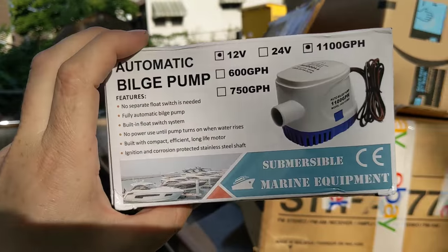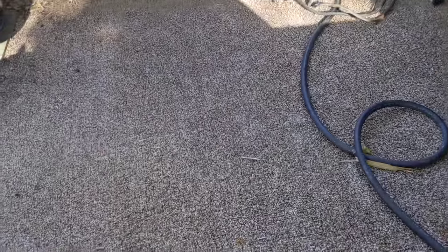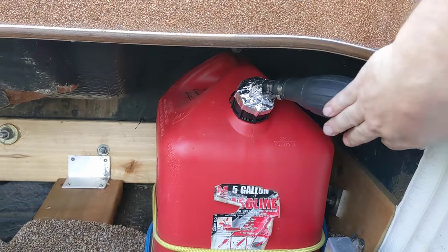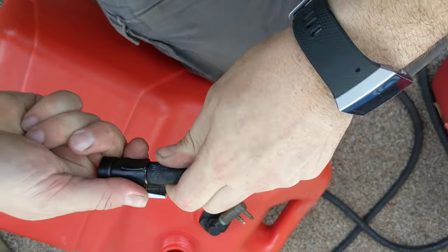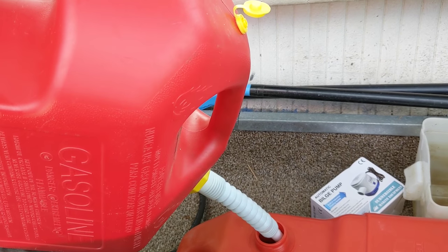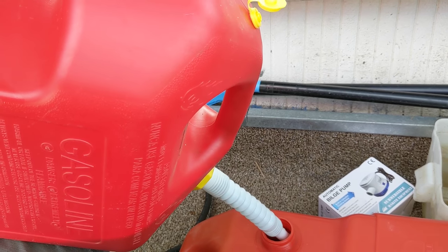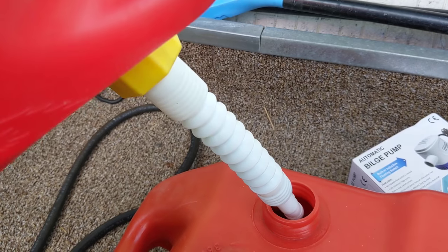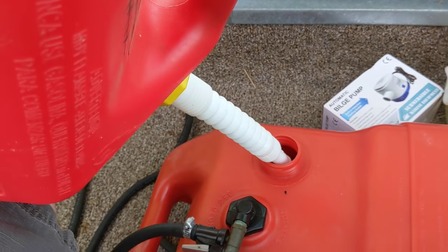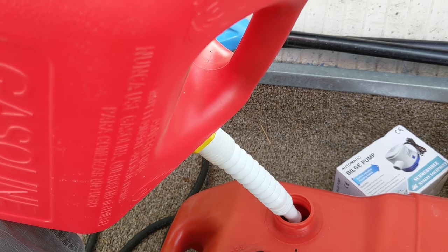I've got a bilge pump, which should help keep it from sinking. I'm going to hold off on installing that because I want to put it in the center where the hull is deepest — that's where all the water builds up. Once we rip this floor up I'll see where I can put it. I've also been using a slightly redneck taped-together tank as my fuel tank, so my other package is a legitimate boat fuel tank. Modern gas cans come with a ridiculous supposedly-safe nozzle which usually ends up spilling way more gas. At the local hardware store you can get old-style nozzles with a little vent cap — these work great, you don't spill a drop.